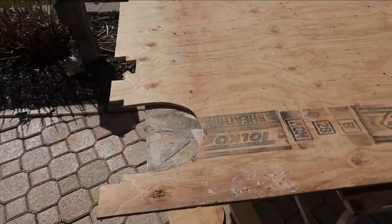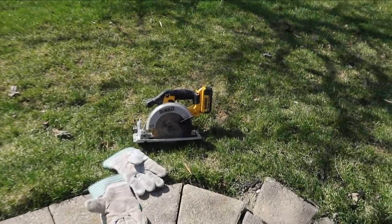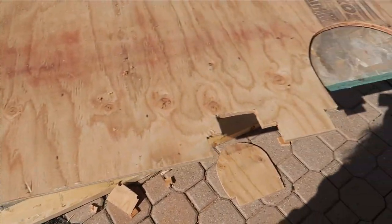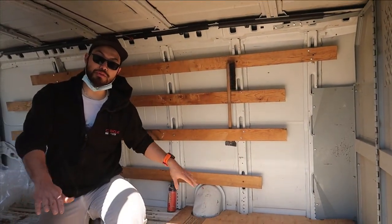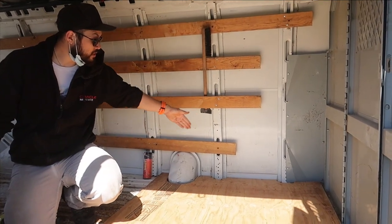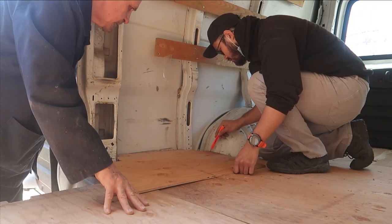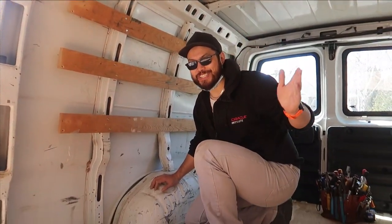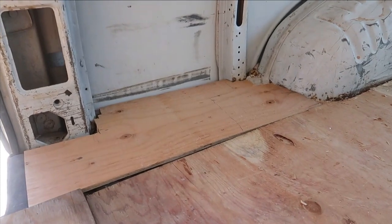I did shop class back in grade school, turns out I still know how to do some things. It's not too hard to use a saw — we used a circular saw to cut our straight lines, then a jigsaw to cut our curved lines, and that's our first piece for the base. The pad that we used actually comes up a little bit, so we need to cut about an inch out of that side so everything will slide in. We need a little bit off of here. Last piece of the subfloor — it's in! We got the subfloor done, everything's good to go.